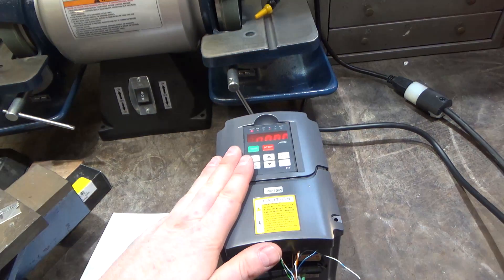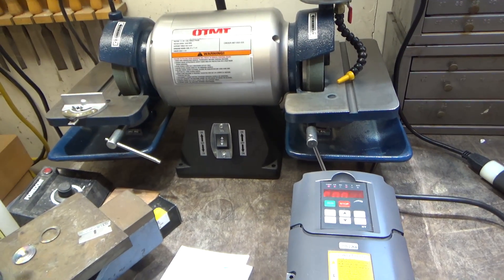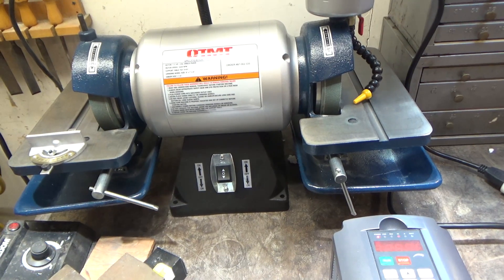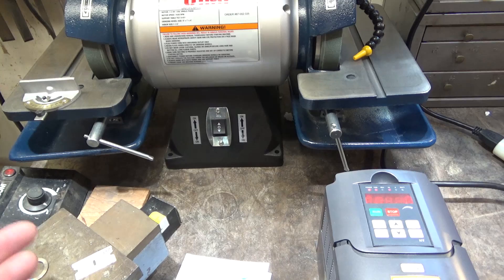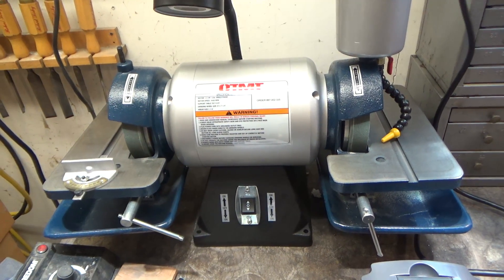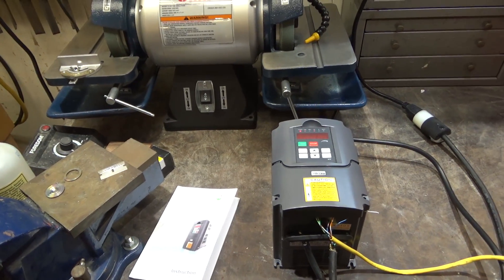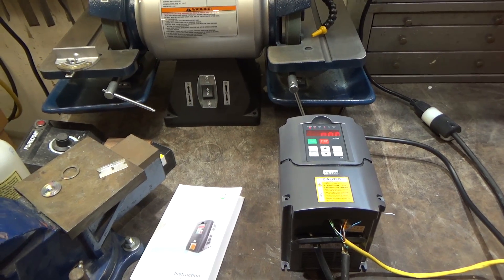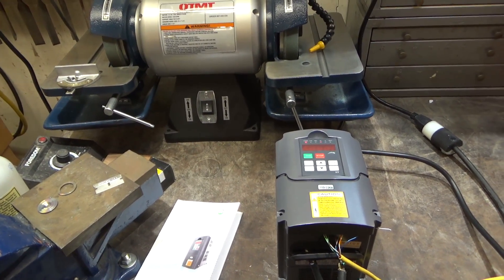One of the advantages of pulse width modulation is that you can get a 2.2-kilowatt unit in a really small package with just one tiny fan. If this were a 2-kilowatt transformer, it would easily be several feet cubed. So it's very compact and efficient, though there are some caveats — it won't work on some motor types like certain fans, but it will drive most motors you'll find in a workshop. For me, I specifically want to make this grinder run slower while keeping the torque, so I can grind tools more carefully since I'm not the most dexterous person. This is actually the second version of this video — I deleted the first one because a viewer pointed out some serious errors in my explanation. I appreciate him for keeping me straight. There's enough bad information on the internet without me adding to it. I hope you find this useful — thanks for watching, hope to see you next time.